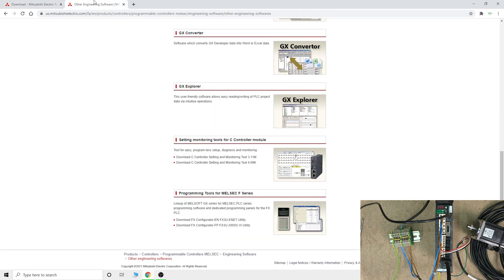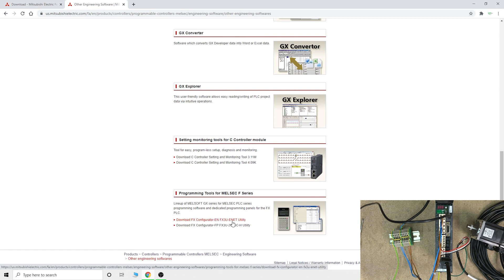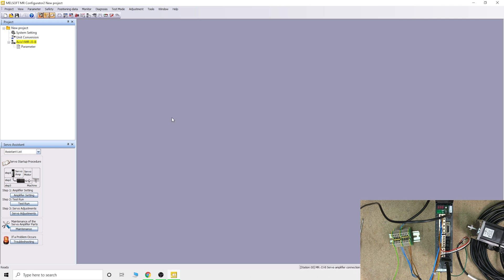All the manuals and everything that will benefit you will be in the description below, and I'll also be leaving additional video links as you progress. There's also a link to download FX Configurator - the FX3U utilities download. For when we're going to be working with the drives, it's this FX3U version - download it. Both links are going to be in the description below. So first let's start with MR Configurator - it loads up because I last worked on MR J3B, and it asks if you want to read the parameters from the servo. So now we've downloaded all the parameters.